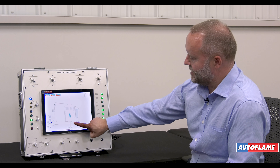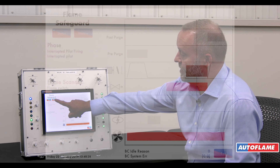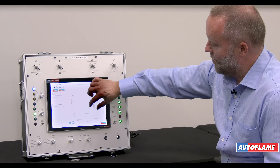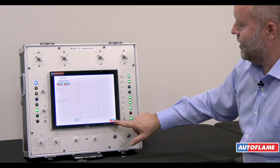This is a class 1 safety device with a built-in flame safeguard. By pressing on the scanner I can actually look at the flame safeguard and also the history. The same with the firing rate — I can zoom in on this graph to see more detailed information, and we're going to get 24 hours of data.